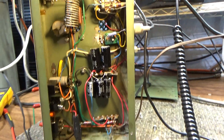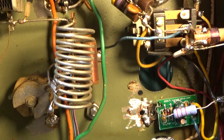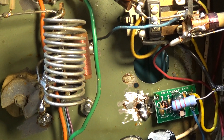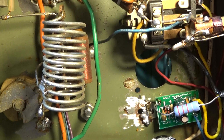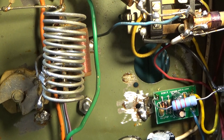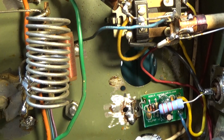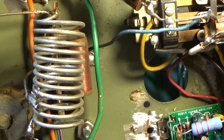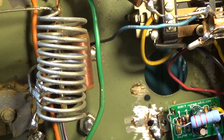12-volt filament, single tube. I always talk about the number of turns in the tank circuit — the less tubes, the more coil turns you need. Since this is a one-tuber and it's set up to be a modulator, it's actually a lighter load on it than average. I think it uses nine turns in this one, but it's on so I'm not sticking my fingers close to that to count it.